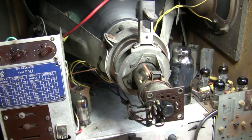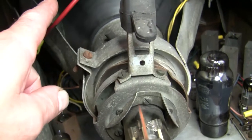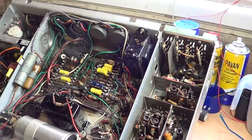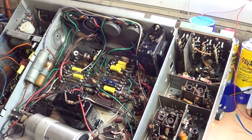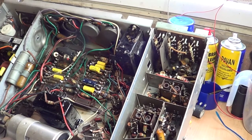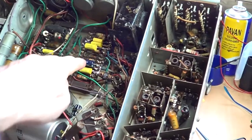The chassis comes in and out very easily on this set — it's got nice plugs that you pull out, obviously coming off the tube, and there's a plug inside with the wires, and the EHT lead comes off there. It's dead easy to slide the chassis in and out. This television set was used quite well in its day and I think at some point during storage — I believe somebody found it locally — it was found in a loft.